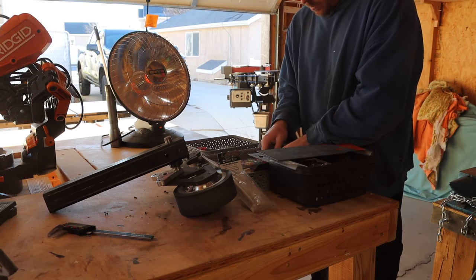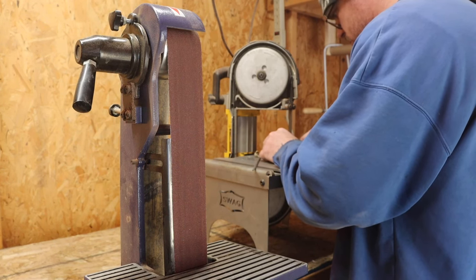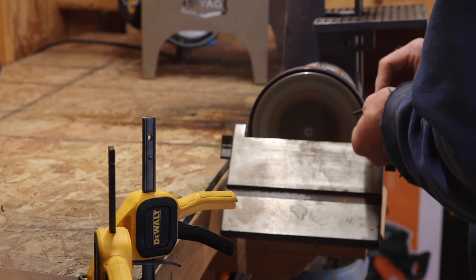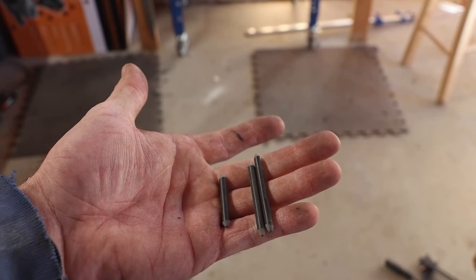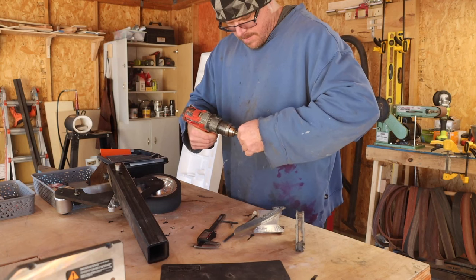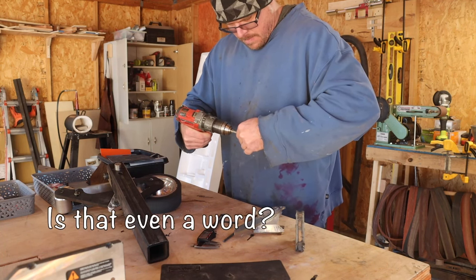Ugh, just like my drill bits, my handle material bin was a mess. Luckily, it didn't take too long to find my micarta pins. I took them over to the porta bandsaw and cut three of them. I then put a slight bevel on the end of the pins, and these three beauties are what I was left with. The pins are slightly oversized, so I put them in my drill and used some sandpaper to take a little material off until they fit snugly.